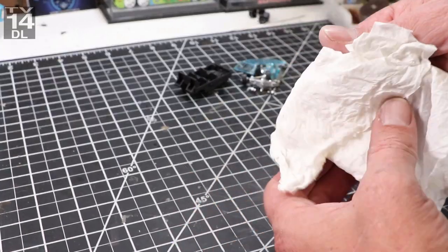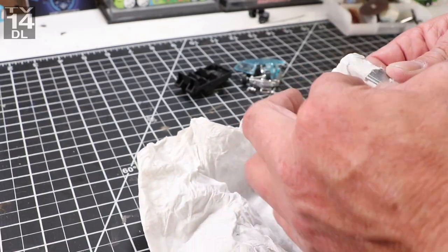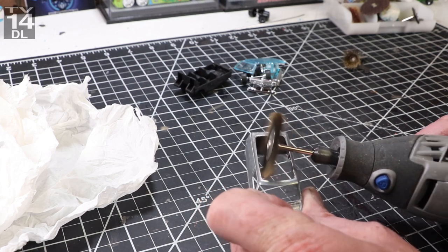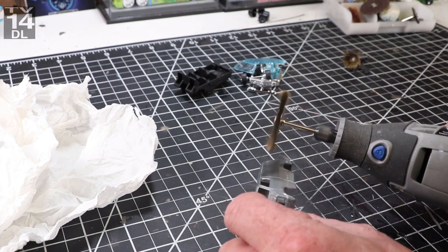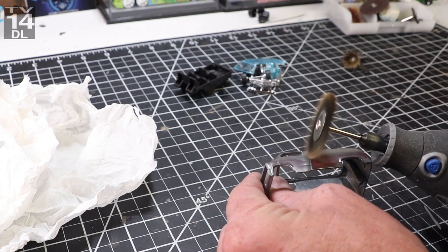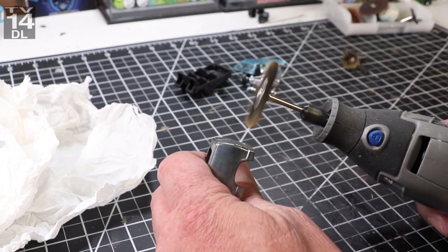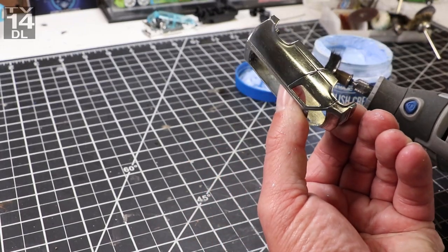I put it in the citrus strip, which worked very well on this one. It doesn't always work — I've had some that have been in there quite a while. After it comes out of the citrus strip, I'll run it under hot water and then take it down with my wire brush attachment. I have brass and regular steel. If you're going to do this at home, wear glasses because the little shards do fly off — they'll get in your clothes, your eyes, your face, and if you have a beard, it'll get in your beard. And they never come out when you wash your clothes.